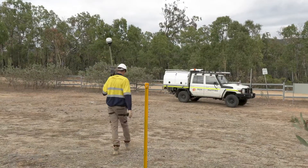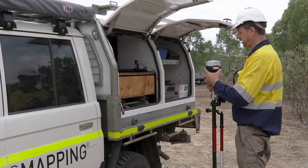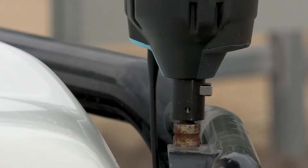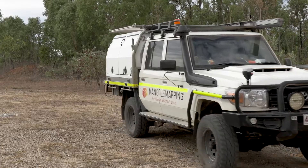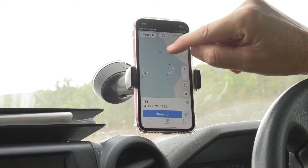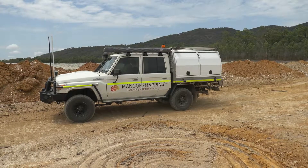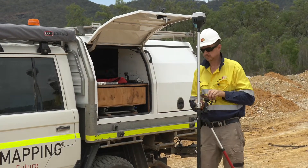Now that we've finished our checks, we can pack down our rover and head out onto site. I've established a quick release point on the top of my rover pole, and on the front of my vehicle I've attached a quick release point so I can rapidly mount and dismount my rover. That allows us to maintain a fix as we drive around the site and quickly mount it back onto the survey pole to keep things moving. With the controller connected to the GPS on the bull bar, I can select a point in the data set and stake out to it — for example, stake out point number 20 — seeing how close I am while moving the vehicle before getting out and properly staking out that point.